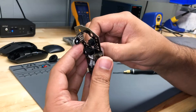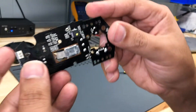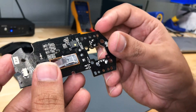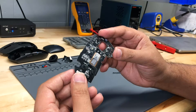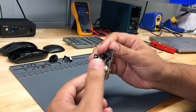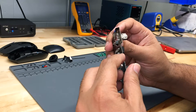I'm going to try to take off this reflector, but it was pretty hard so I left it on for now — I didn't want to break it. There's the main microcontroller; it's a NRF52810, which is very common. We're very used to using it and will probably use it for this project as well. Some more examining of the board — it's the first time I've seen it, so just trying to take it all in. That's the scroll wheel button, and that's pretty much it — there isn't that much to this board.